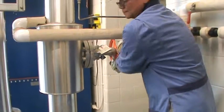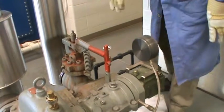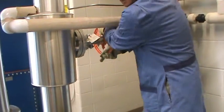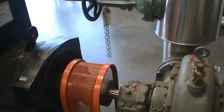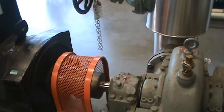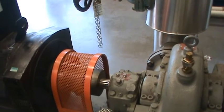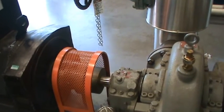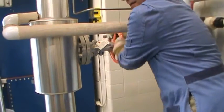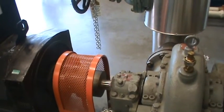I'm going to close the steam valve to the turbine and then reset the over-speed trip — just pull it up. Then I can slowly open the steam valve again and make the turbine turn. Usually when the turbine is cold, we have to run it slow for 15 minutes before putting it online, but today we've already warmed up the turbine, so I'm going to slowly open up the steam valve and bring it up to operating speed.